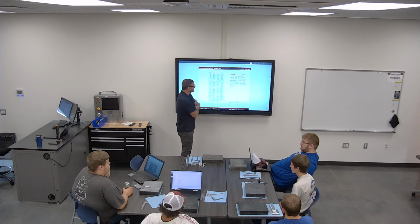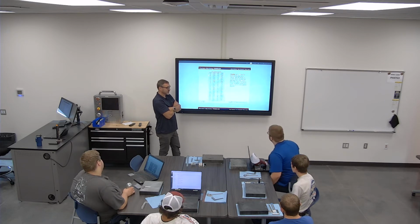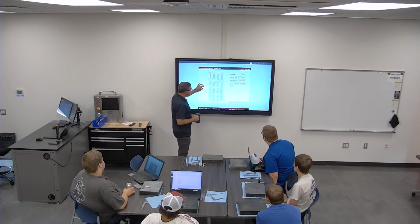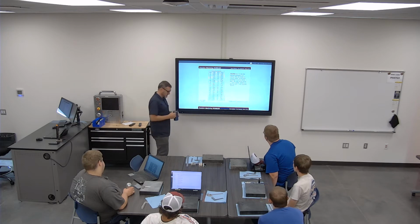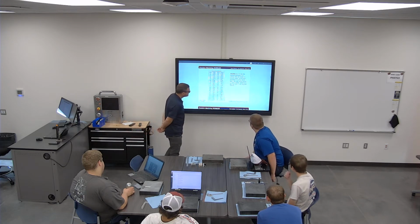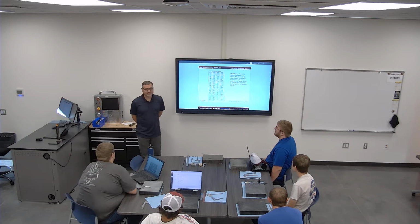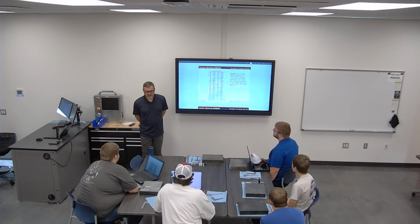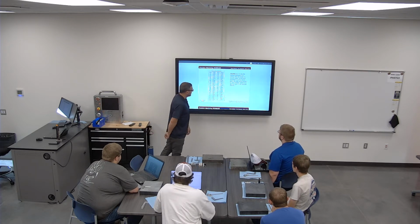So, yeah. All right, so how do you say 13/16, Cole? In decimal form, how do you say it? 13/16. Make it bigger. Is that 0.8 1 or 0.8125? It is, but how do you say it? Anybody else? 812 and 5/10 thousandths. Yes. Or you could round up to 813 thousandths.